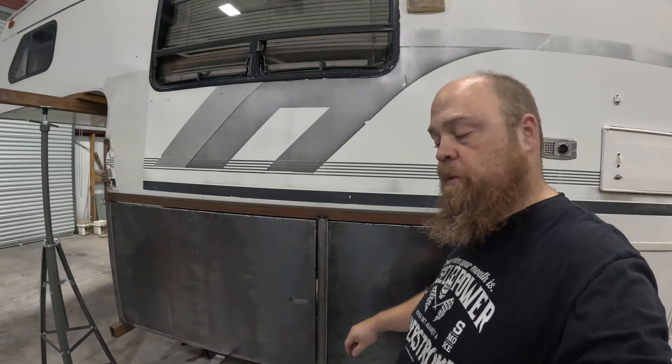Welcome back — it's a new day in the shop. It's actually been a couple of days, and that's given me time to complete the other two doors on this side of the rig. Next steps: I'm going to pull the doors back off because I need to get up into some of these corners to do some welding anyway. I'll pull them off both sides, get the frame out from underneath the camper, finish weld it, and then go ahead and add some sheet metal here to close things in. Once all the welding is done and those pieces are back in, it's going to be time for paint.